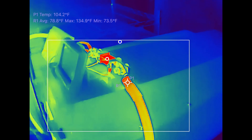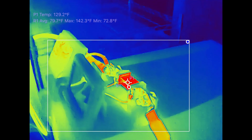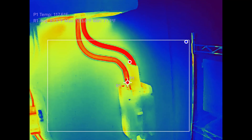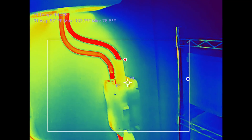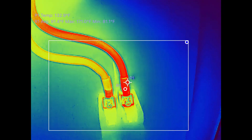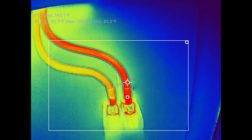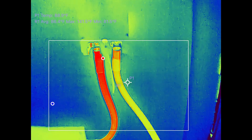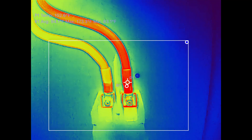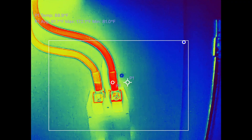Checking six minutes later, my black cable is at 134 degrees Fahrenheit. The resistor is very hot — 142 degrees. You can still touch 140 degrees Fahrenheit and not burn yourself. But over here is more worrisome: getting a little bit warm at the battery cable input — 171 degrees Fahrenheit. Working temperature for these cables is 105°C. It's not reaching much higher than that, so I think we're okay. Somehow this cable is getting a little bit warmer; I might need to tighten that later — it might be a tightening issue.